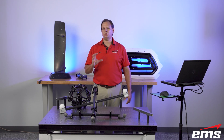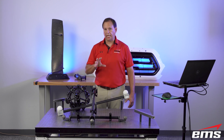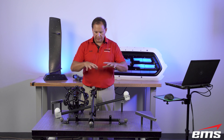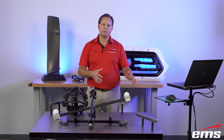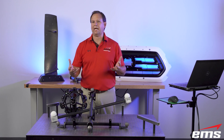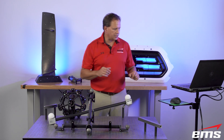The MetroScan system has two modes you can scan or probe in: static and dynamic. We're going to use static to start and show dynamic later. Basically what static mode means is nothing can move — the ball bars and the C-Track, which is just off screen, none of that can move. If I bump the table or knock something, we're going to lose our accuracy. That's how traditional CMMs and arm-based and even tripod-mounted structured light systems work in static mode. We use that about 20% of the time and use dynamic mode more often. But let's go ahead and get started.